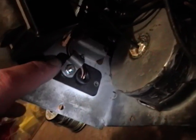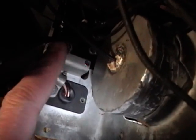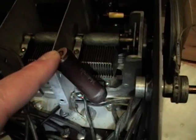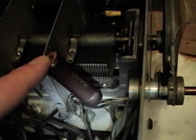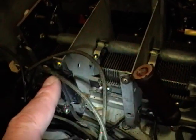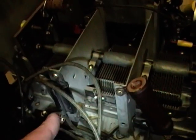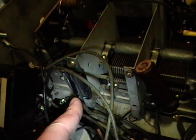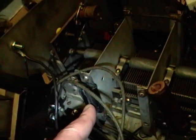I've got the clamp on the power cord, I've got it soldered in, I've got the fuse block on there, I've got the safety cap in place, and I've got the substitute bias resistor. I noticed that on this bracket here there were the same mounting holes, so I took the old bias resistor and just screwed it in over here — so if in the future I get the right 183s, I can simply use this resistor. I'm going to flip this back over and I think I'm just about ready to power back up.